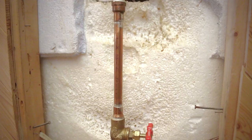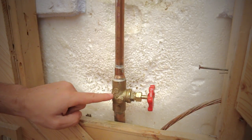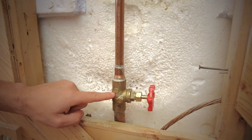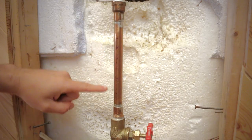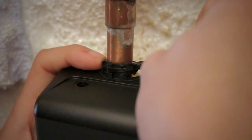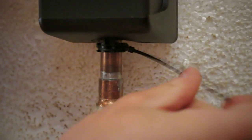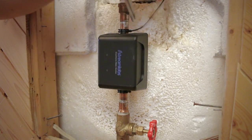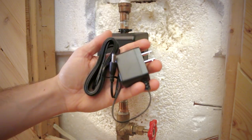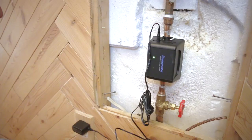Let's go through the installation. First, make sure you have access to your main water valve, as the monitor must be installed right after it as shown in the instruction manual. Also make sure you have at least 6 inches of clean straight pipe. Use the included zip ties to secure the monitor in place on top and at the bottom. For aesthetics, you could cut off the excess of each zip tie to make things look clean. Then connect your power outlet to the monitor and then to the wall. You'll see all the lights turn on showing that it's powered up.